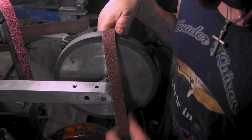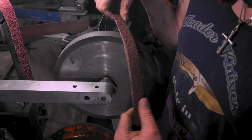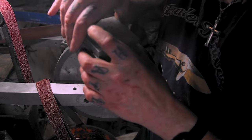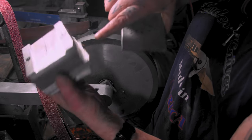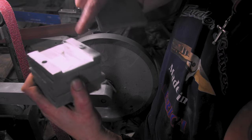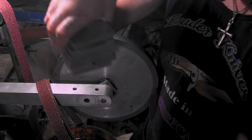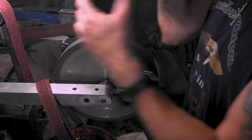I don't buy one-inch belts. They sell them but they're a lot more expensive than buying a two-inch belt. These VSM belts are good expensive, and I went to look at other belts — man, they're way up there. Anyway, I digress. I make my own belt cutter — I made this years ago. It's got a slit here, a slit here, slit there. It just squeezes the razor blade together and then it's got bolts holding it all together. This is all hollowed out so I can put it over the bolts and just wham — I don't have to worry about my hand getting all messed up. Let's put all this away because we're doing the flat platen first.